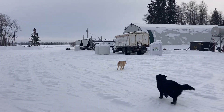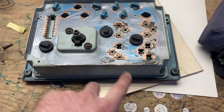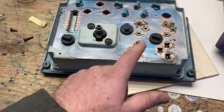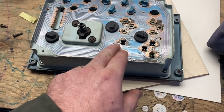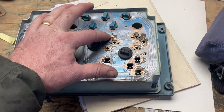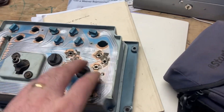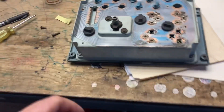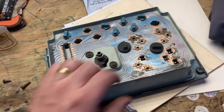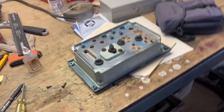This is the dash out of that 580 backhoe - it's a printed circuit dash. These clips I need, I've been looking for them on and off without dedicating a whole bunch of time to it until yesterday when I took it out. I realized it would probably work if they were all in there. A few were missing, and some are loose, so they don't make good contact, and obviously the gauges can't work if these aren't all right. I did message a guy involved in the automotive industry - I'm not sure if he's a partsman or a manager.